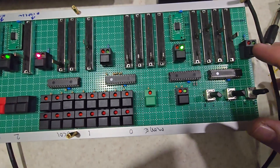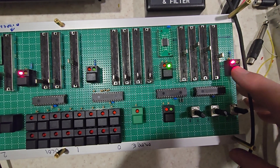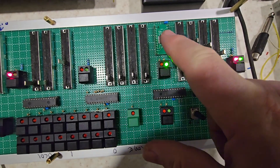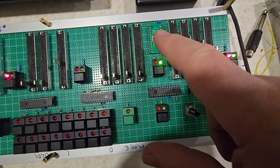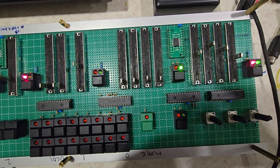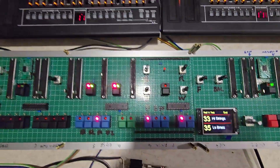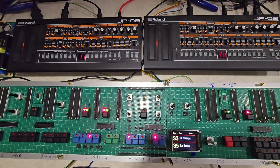Down here the only difference is the key follow: there's just one button which cycles through off, one, two, and both — I could have broken it into two switches but ran out of mux chip space, so I left it. Everything else is working. I'm just waiting to get a chassis to put it all in. The only thing that bothers me now is that Behringer are about to bring out the JT-16, which makes this redundant — but I guess it still saves me about a thousand pounds.